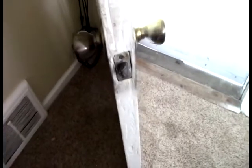Okay. I'm just going to work this here. Just going to work it around. Get some of that graphite getting that action going. Alright. Okay, so doing it on the mechanism wasn't doing the trick completely, so what I did was wound up shooting some in through the actual latch. And you can see graphite is a dirty business. And so you definitely are going to want to try to, a little goes a long way.